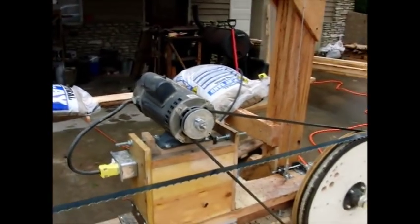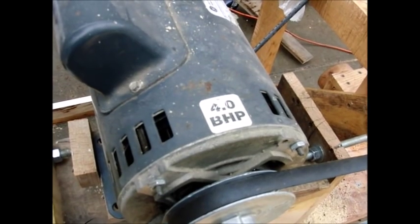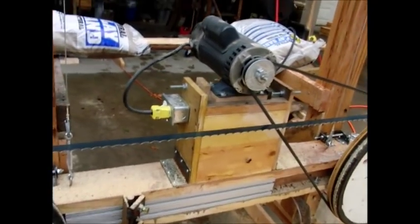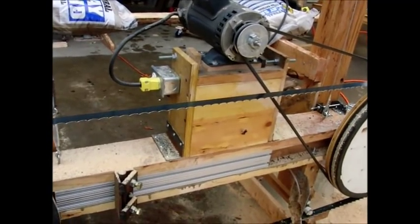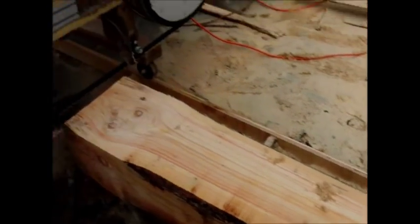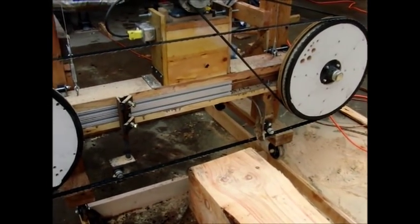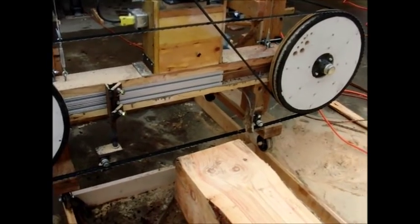This is a 4 horsepower motor — the label here has the brake horsepower, BHP. I've done some internet research and I think that is basically equivalent to a standard horsepower, though there seems to be lots of controversy about that. It is adequate for cutting these logs. I've got to slow down a little bit when I go through knots. I have not tried to cut hardwood yet. My blade speed is 3,000 feet per minute, and with the 4 horsepower motor that seems to be okay. I think a little more horsepower would be good — maybe a 5 or a 6.